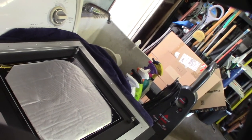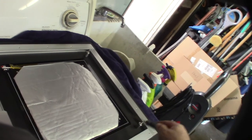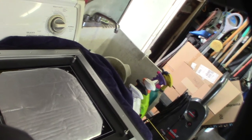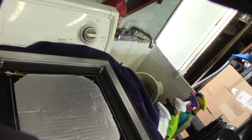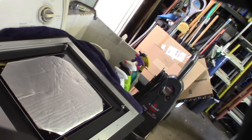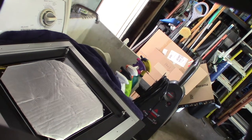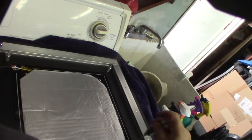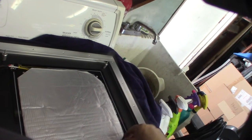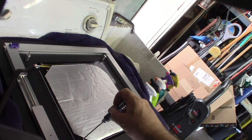This printer is probably five or six years old. You can see the heated bed doesn't go over the edges. You could sometimes overheat it - say if you're printing PLA at 60 degrees on the bed, you could heat it to 70 or 80 - but the problem is the power supply can't handle that. The AC heated bed will be much improved, though it still heats more in the center than the outside.